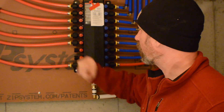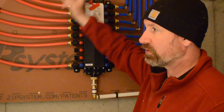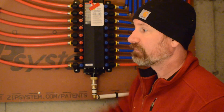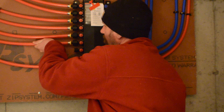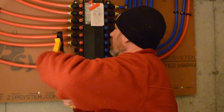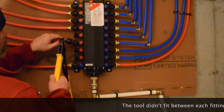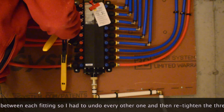I'm going to make sure each one of these is still in, crimp it, and this will be tight. Then I've got to come up here — this is going to be my hot water intake that goes over to my boiler. For today, I'm just going to come up and I bought a plug and I'm just going to plug that so that I can pressurize this whole system. And then I'll start tying into the hot water side of this.